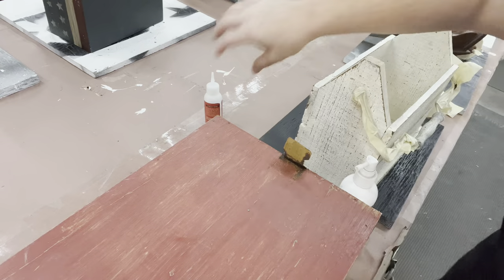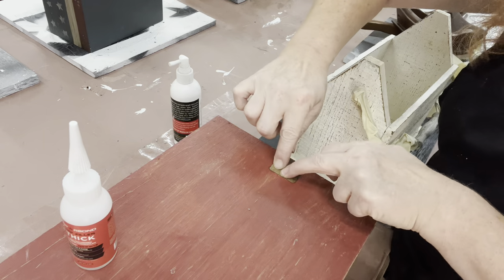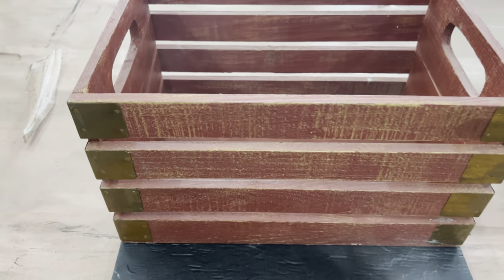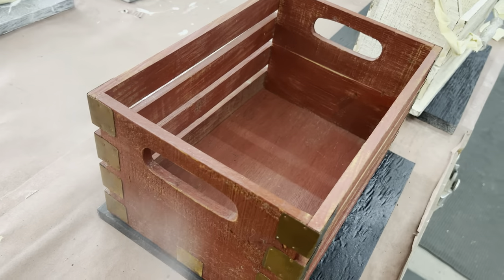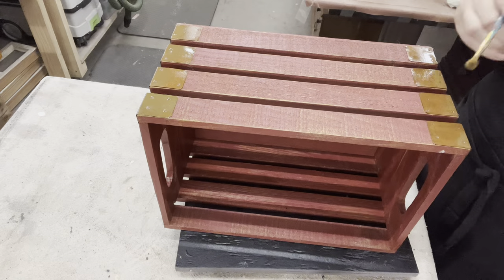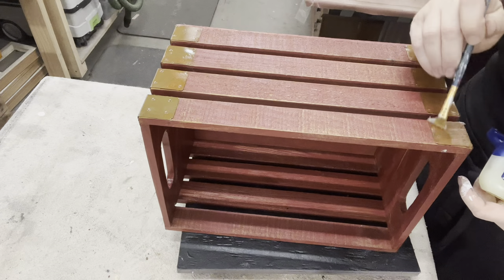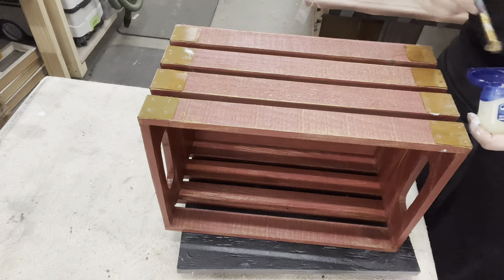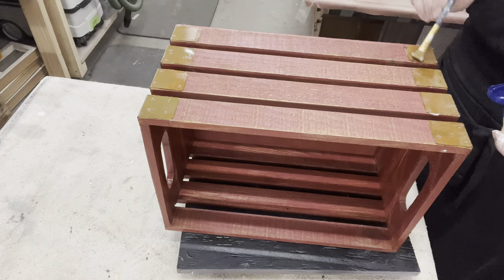So next project I'm working on is this red crate. The bottom had a loose piece of hardware — I absolutely love the color of the hardware, so I'm just going to use some CA glue to get it tacked back down. Even though I'm probably going to cover this whole thing up, it's a really weird texture — really dry and really grabby. So I'm going to get this sealed in with some shellac. I love the color of the hardware, those corner protectors, but I don't want to spend the time to tape them all off. So I'm going to go in with a paintbrush and some Vaseline and use that as a protective so the paint doesn't stay on them.